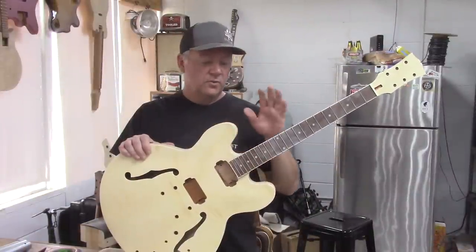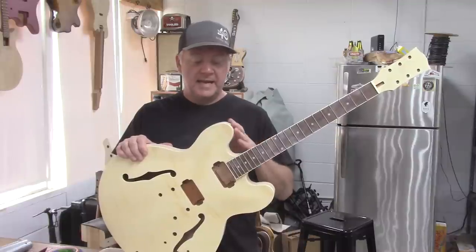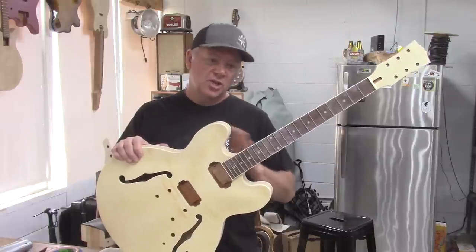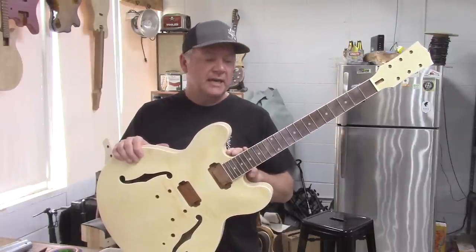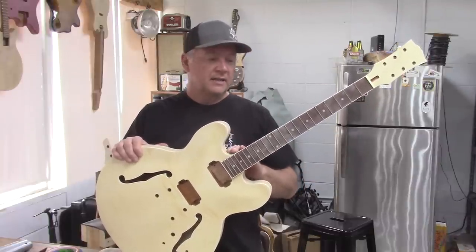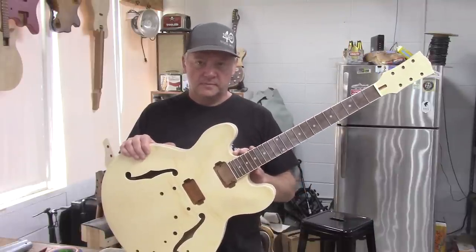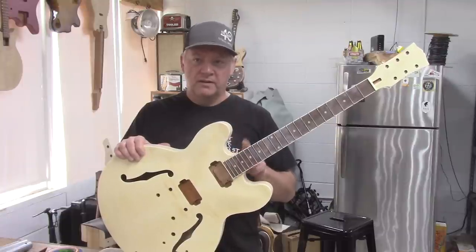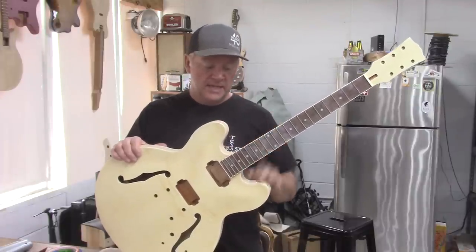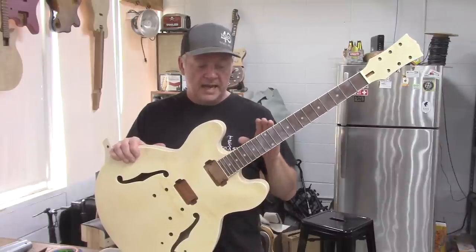In the last video, we shot it with our sealer coats, and in between that video and this video, I sanded it, honestly thinking that we were probably going to have to do more sealer, and as it turned out, we don't, so you guys don't have to watch me sand. But basically what I did was I sanded everything with 320 grit sandpaper and got everything perfect in every way. So some people are going to go, I thought you said not to sand it. That was the raw wood. Now is time to sand it. And that was actually the first time that we sanded the body. So I sanded it with 320 grit sandpaper. And now we're going to wipe it off with naphtha and mask it off.